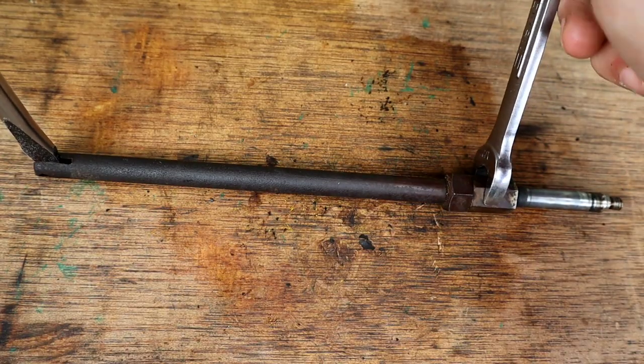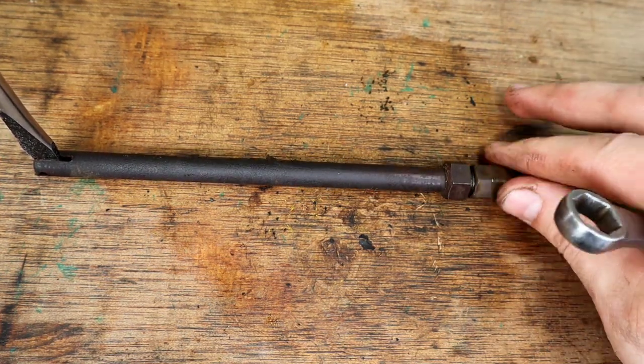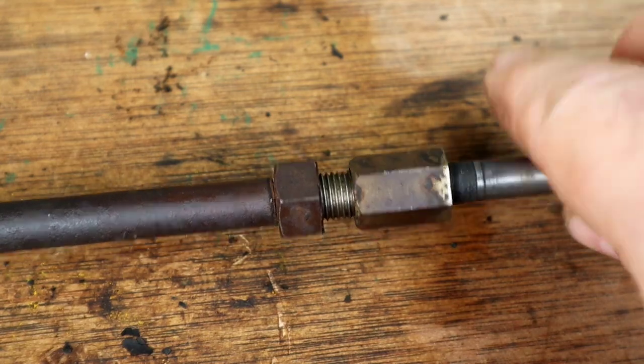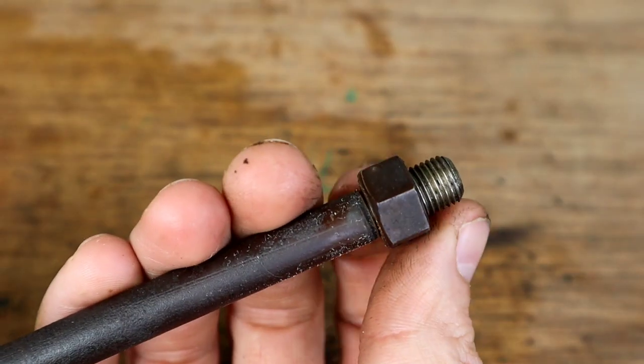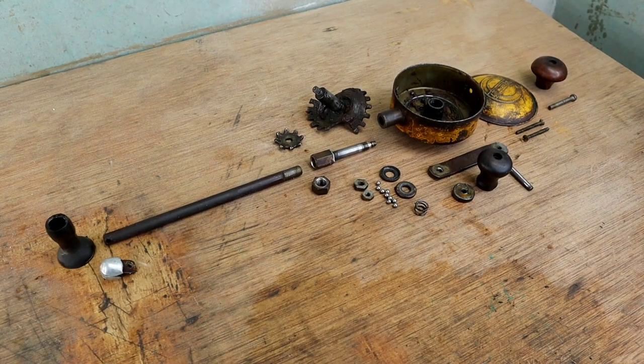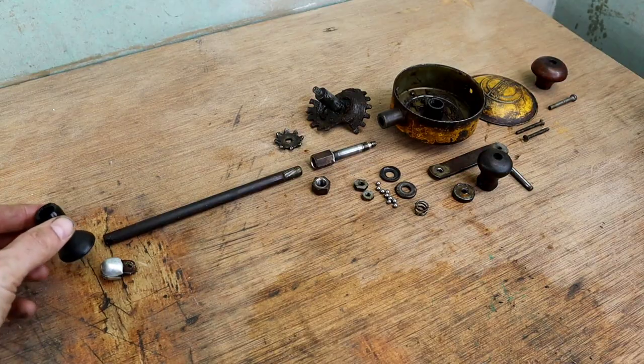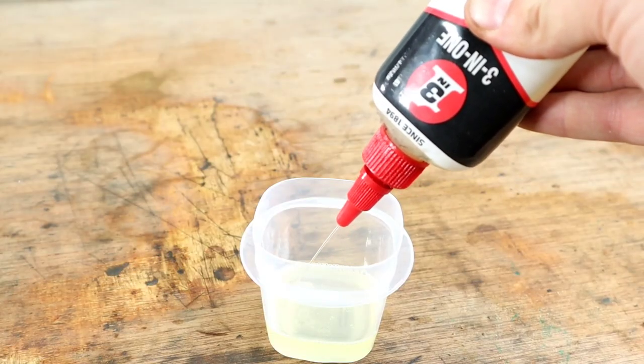To remove the shaft, brace the extension piece with a 7/16 inch wrench, and while removing all these pieces, look for anything that needs the threads restored. Check out the garland hammer restoration for tips on how to use a thread file to do this — I left a link in the description below. With the tool completely broken down, it's time to bring these parts back to life. I started with the vacuum cup because it's the piece I'm most worried about.